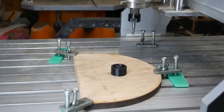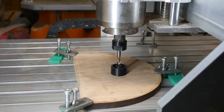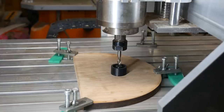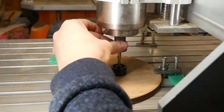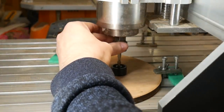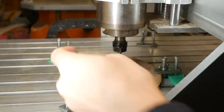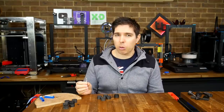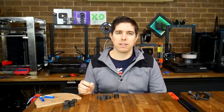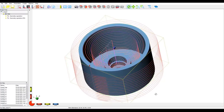I moved the cutting bit into the rough position before switching to 0.1mm increments to lower it down just above the printed piece. To help with final alignment, I would turn the spindle by hand, which allowed me to better align the end mill with the correct homing spot. Once I was confident, I zeroed the machine. Finally the moment of truth — and things started poorly, but I was able to refine. I used the CAM software DeskProto for this experiment, and this was my final toolpath — in fact, iteration number 6, so let's look at how we got there.